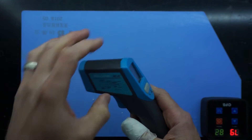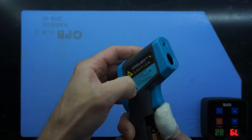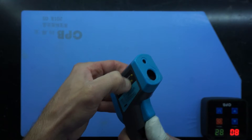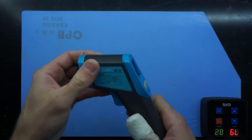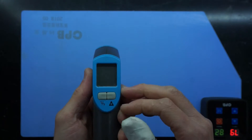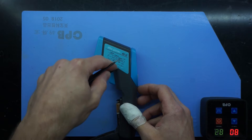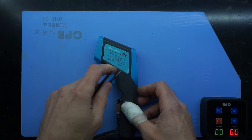It looks like it's only got a single screw holding it together, which I believe is under here. I can't really feel one on the other side, so if I'm lucky it should hopefully just be a single screw holding it together. Then I can get in, push this back in, and hopefully the LCD will display once more. I've had it on the heat pad here getting warm at 80 degrees Celsius.